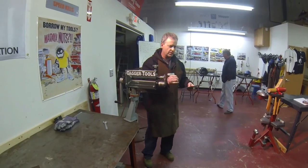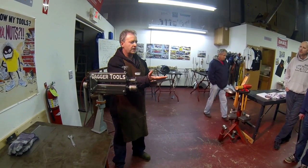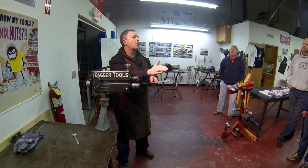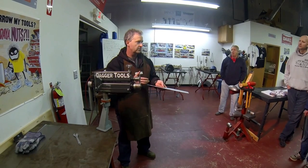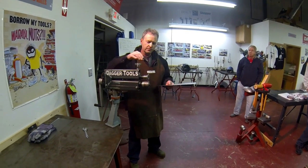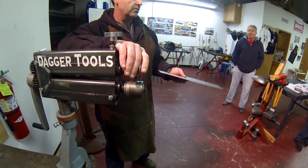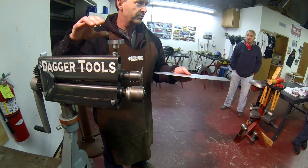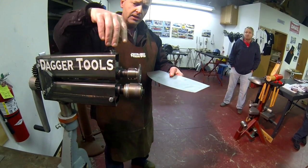In this exercise we're going to use the tipping wheel to create a 90 degree bend, or as far up as possible to trap the wire. Each piece of equipment has some play in it, or backlash. What you need to do is take up the backlash in whatever piece of equipment you have. So what I like to do is just bring it down so it has tension on it.